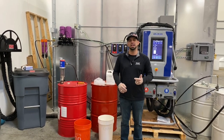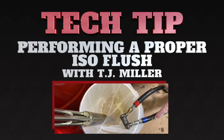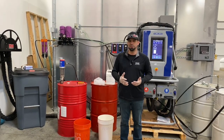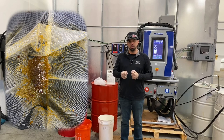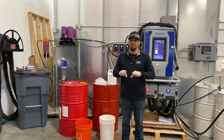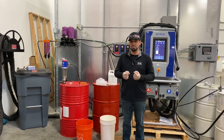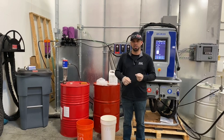Hey guys, TJ Miller with IDI. Today's video is about flushing the A-side. Unfortunately, this equipment had sat for too long. As you can see, there was too much gravel — barrel gravel is what I like to call it — coming out of our hose and catching in the filter when we were trying to strain the material. By seeing that and hearing that cracking inside the supply line and even sometimes inside the spray hose, I know at that point that the A-side needs to be flushed out.